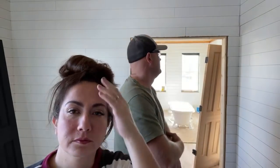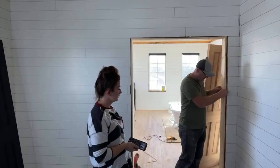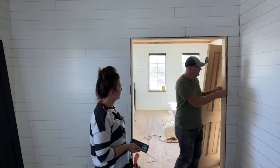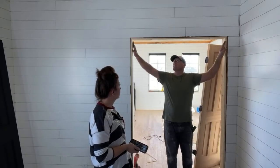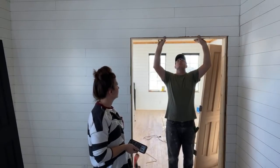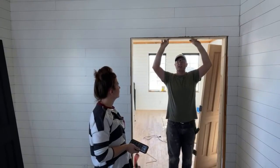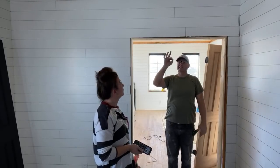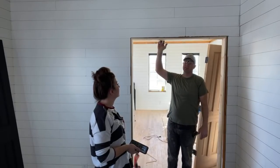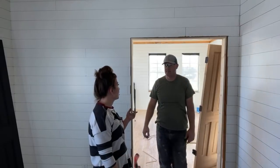It's going to take me longer than 10 minutes left to finish this, so let me walk you through it real quick. I've got little shim boards that go up in the back here. I'll level it out nice and plumb, make sure I've got enough room in between on the bottom for the two doors, then fasten the top. You don't want to nail the top end too hard — the sides are what hold this in. If you nail the top too aggressively, it'll arch or sag.